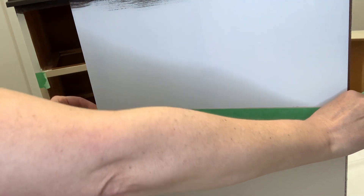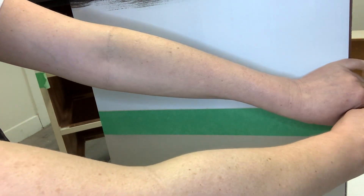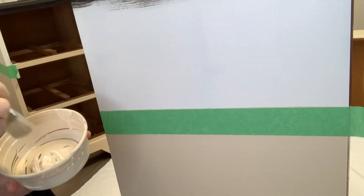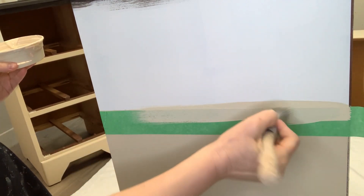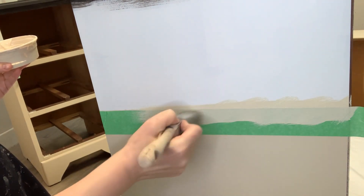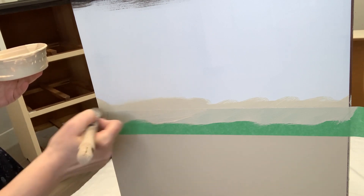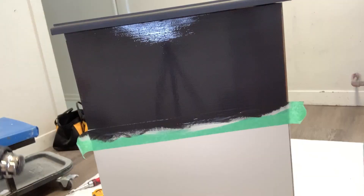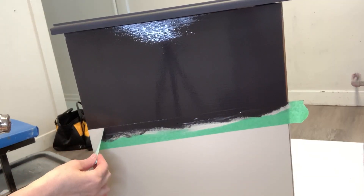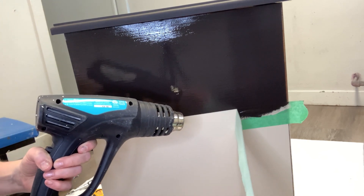To finish off my dipped painted look, I added green painter's tape to the Sandcastle area, making sure the line was lined up perfectly. Here's another quick tip to get a perfectly crisp painted line: use your original paint color and paint it over the painter's tape before painting your second color. Here I'm using the Sandcastle over the tape on top, letting it dry, then going in with coffee bean. While the second color is still wet, I remove the painter's tape — a little heat helps it come off easily — and the line is perfectly crisp with great high contrast between the light and the dark.